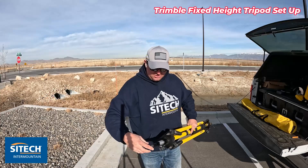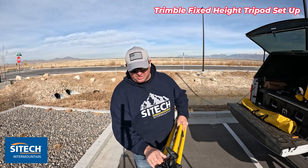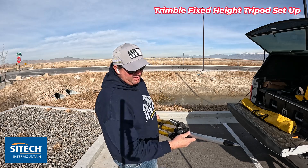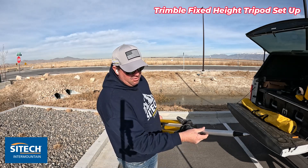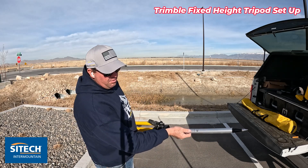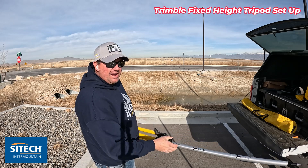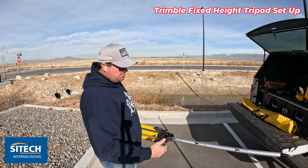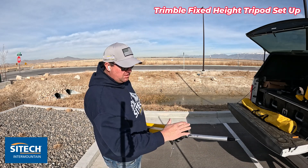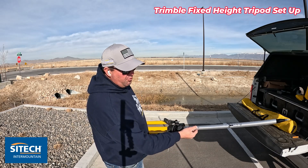Let's go ahead and set it up. First things first, I always screw the point on and then set the height I want. I spin this, pull out the little pin right here, and loosen this nut so I can slide it out. You don't want to just crank it down at whatever height you think of. If you look on here, there's a pin hole for 1.5 meters, one for 1.8, and one for 2. In my opinion, 2 meters is pretty high — it makes the base really high — and 1.5 meters makes the base really low. So I personally go with 1.8 meters.